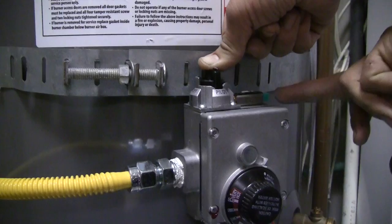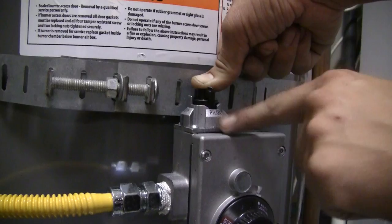Down in here you should see a flame now — right there. Very important: I'm continuing to hold it up here on top. You have to hold this for about 30 to 45 seconds. Do not let that go. I've clicked the igniter while holding the pilot button downward and I'm continuing to hold.